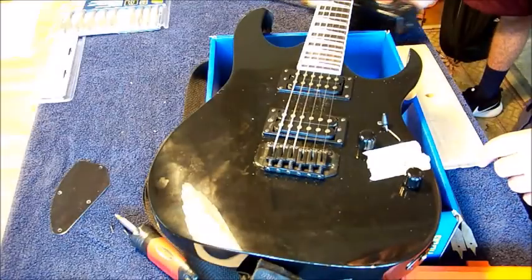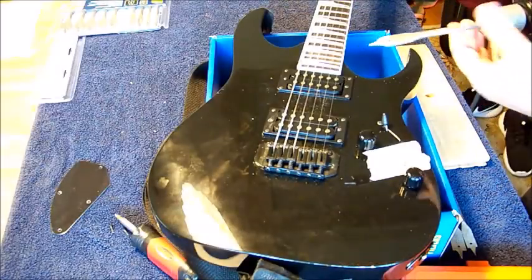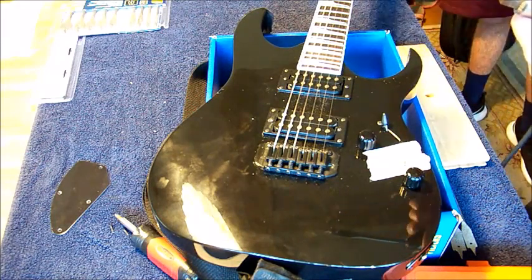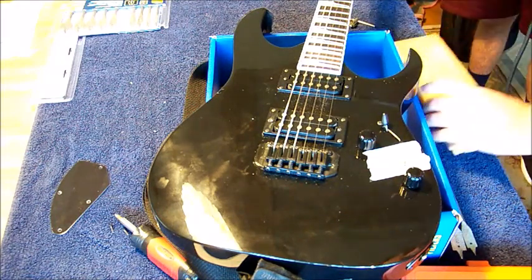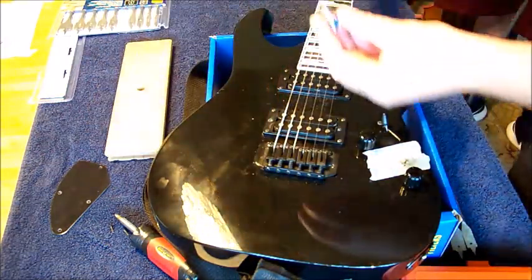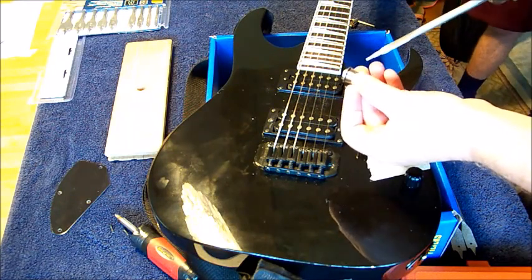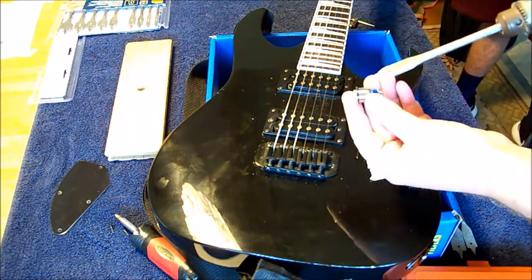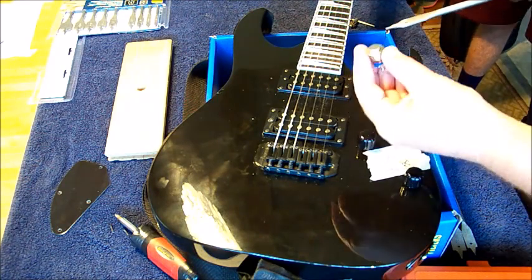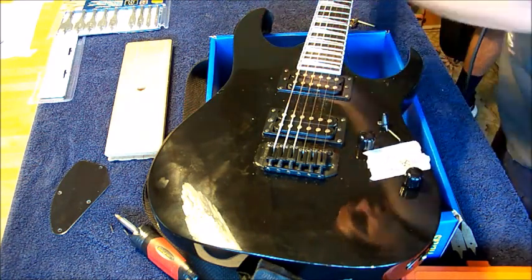So, I didn't have the right drill bit, so we ran to the local hardware store and picked up the right size. It's 5/8. I checked it by drilling into a piece of wood just to make sure, because with the threads on this push button screw, the hole has to be bigger than the threads, but smaller than that little tiny lip on the top.